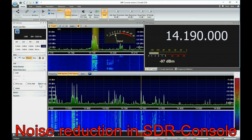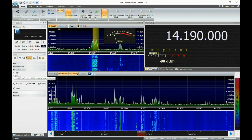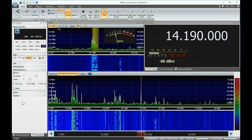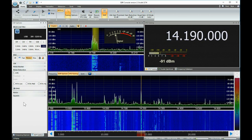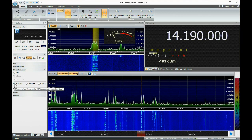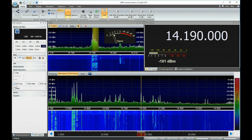6 inches away from the microphone without the processing, and your signal has come up almost 10 to 12 dB. Your signal is almost 2 S-units stronger at a solid S9 and a little bit over. On this old, old transceiver, it's calibrated at 100 microvolts for S9. And your signal has not varied from S9-plus with the way you have it right now. It makes all the difference in the world.